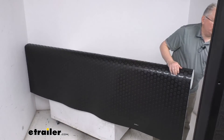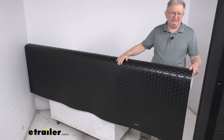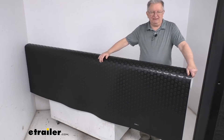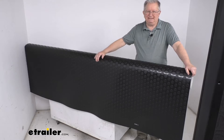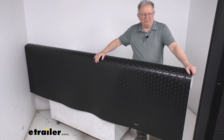The installation on this is very quick and easy. You just simply cut the flooring to the size you need and then place it over the subfloor. We do recommend using the appropriate subfloor adhesive for a more permanent installation — we sell that separately on our website. For a wood subfloor, we recommend part number TS-76FR.